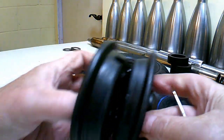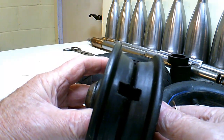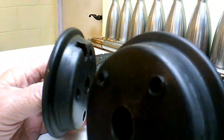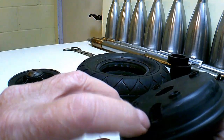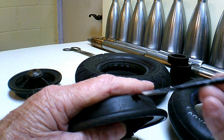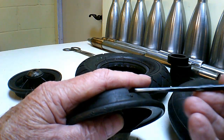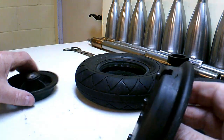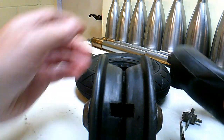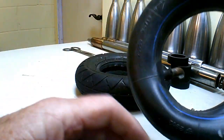You'll notice that on the two halves of this thing, if you put them together, they're both at the same spot. But probably for balance reasons I assembled it so that the notch was opposite where the Schrader valve was, and therefore rubber could go through there. When they're bolted together it isn't too much of a gap, but it can extrude in that area. So I'm going to put a piece of tape on there so it can't extrude through there again, and I'll also put the notch in line with the Schrader valve, because the rubber around the Schrader valve is quite a bit thicker and heavier where they glued it on, so I'll have less chance of getting a hole.